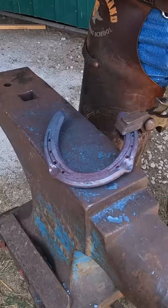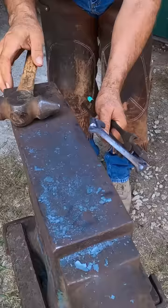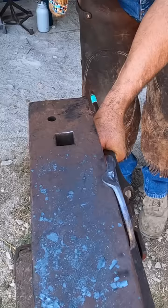Alright, come to the back of my anvil, my shoulder is straight with this line, I hold at an angle, I hit flat, and I turn my left hand, use the corner of the hammer to forge out my clip. At an angle, I hit flat, my left hand is moving over near the corner of my hammer to draw out my clip.